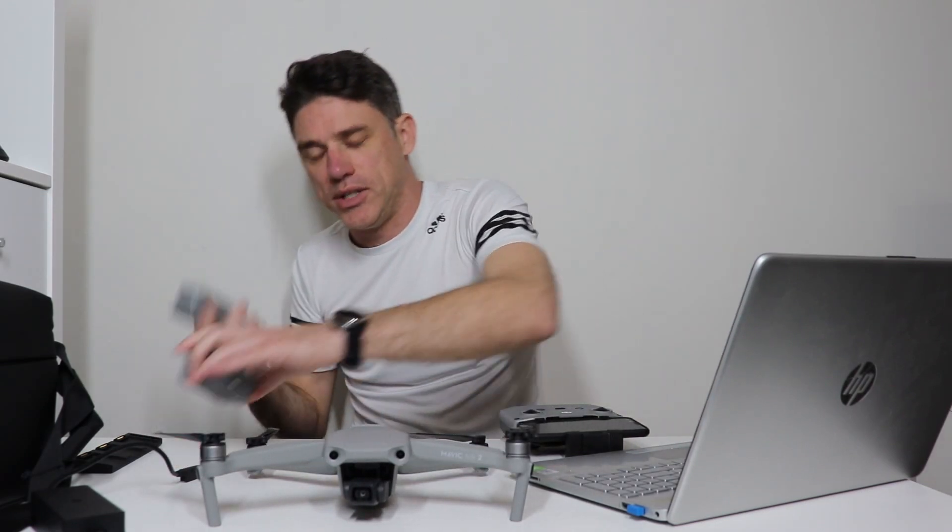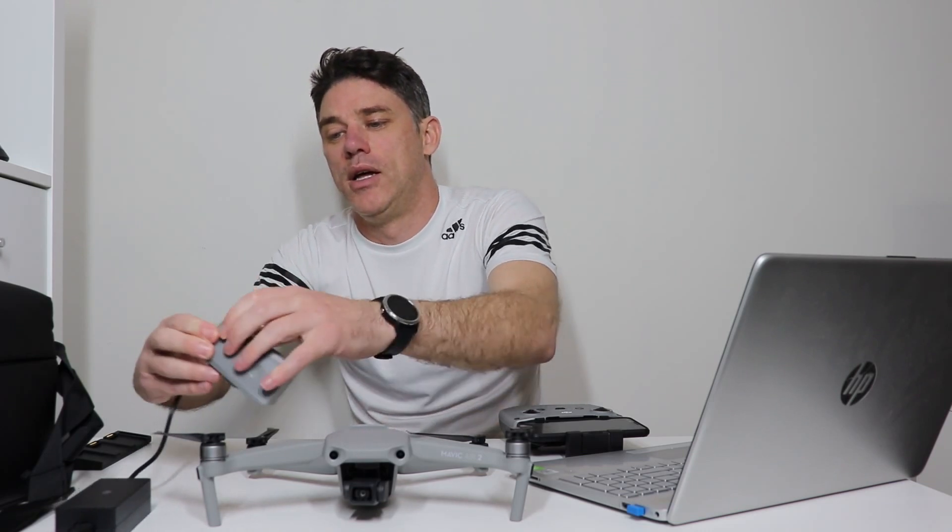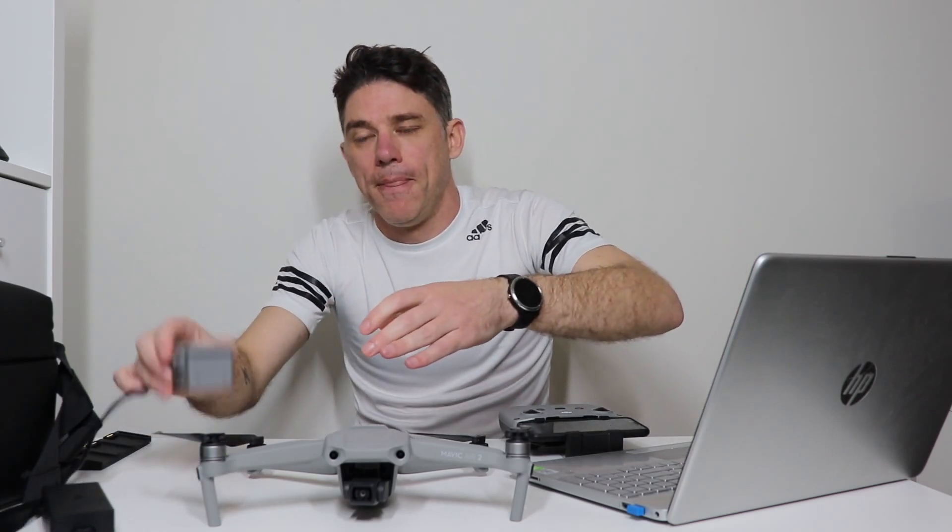That's on purpose. If this happens or you're getting a battery error, and the battery is completely dead, that's fine — it just means it's in hibernation mode. All you need to do is grab your actual charger. Don't charge your batteries with the multi-charger for the very first time — ignore it for now. Connect the battery directly to the charger and Bob's your uncle — it'll start coming out of hibernation.